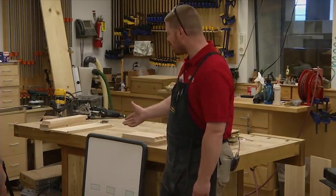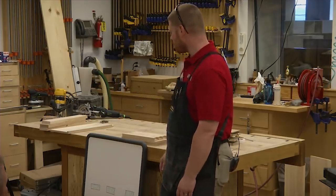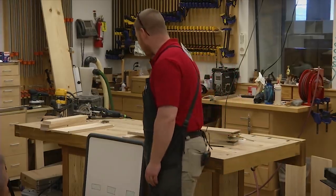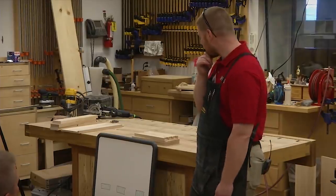With this, you just walk up and say, what size drawer do I need? Cut that drawer face, cut the joints to where I want them, and then scribe the side to fit, and it'll go right together. So that's how we did those on the Tansu.